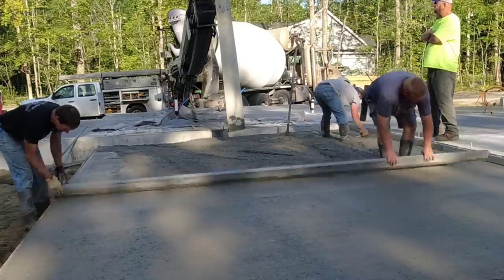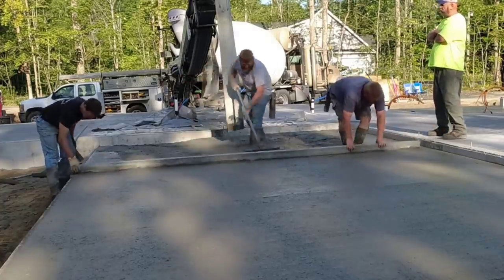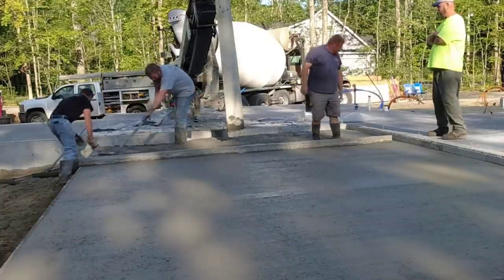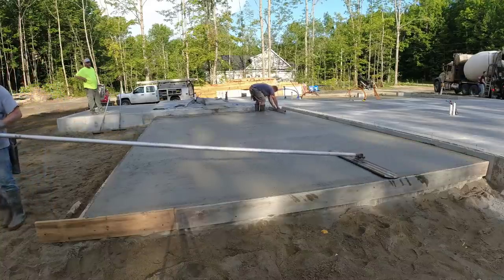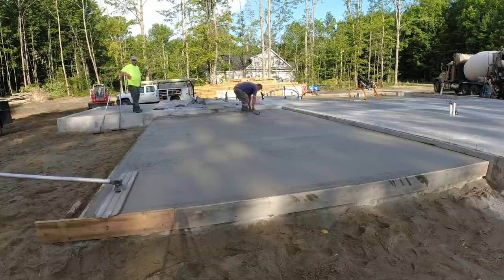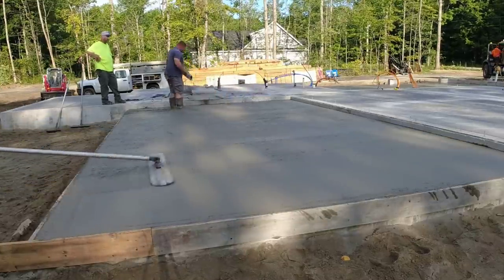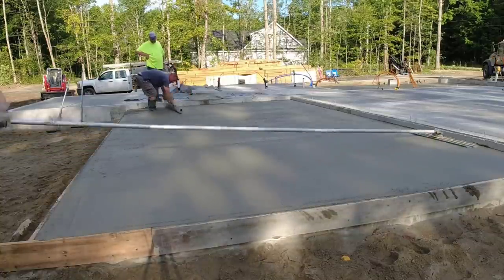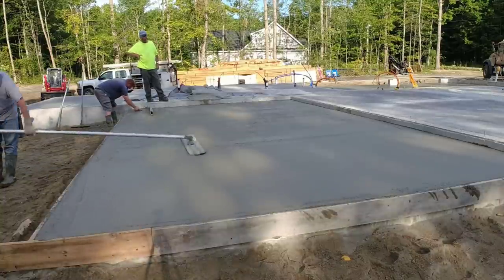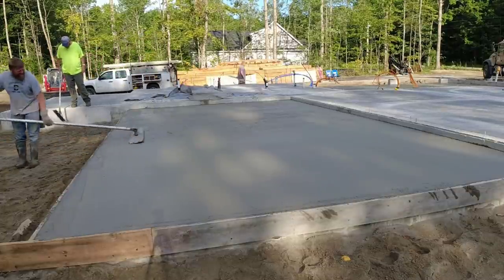That's me and Luke on the straight edge — we're getting this thing screeded. It's about a 14-foot straight edge, so it was roughly a 14 to 15 foot by 24 foot patio. It's just going to have a light broom finish when we're done. We actually poured the garage floor first — that's in the background on the right — then this patio, and then there's another patio over to the right as well. So there are actually three separate pours we're doing this morning.